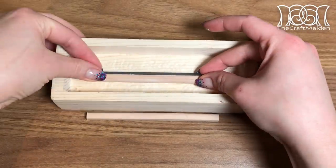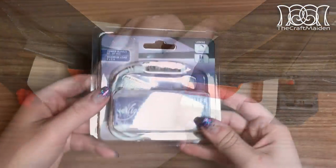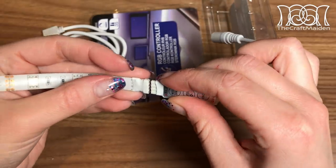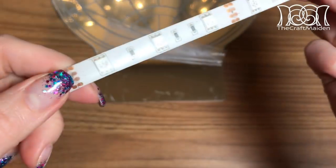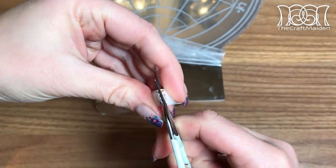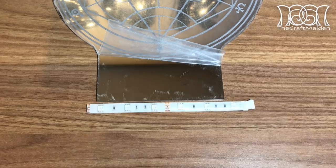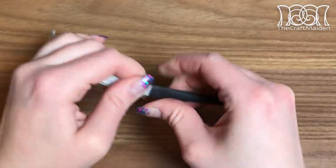As I didn't have room for a big LED driver underneath the base I had to find another way to turn on the light and change the color. After a bit of searching I found a really tiny RGB controller that you only need to plug in and it's ready to use. When working with LED strips remember that you can only cut them where it says you can do so, otherwise the LEDs won't light up. This time I didn't have to solder on any connections, but if you want to see how I did last time you can watch my Hogwarts silhouette lamp — the link is in the description box or up in the corner. As I had one too many LEDs on the end of the strip I covered it and the edge with black heat shrink tubing.